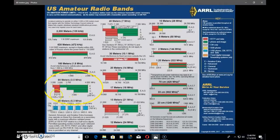Now, there's something you don't see on the chart that you may have heard people refer to, and that's 75 meters. People say, let's get on 75 meters, and you think — where is that on the chart? 75 meters is what some people refer to as the upper portion where the phone is, and they call 80 meters the lower portion where CW and data is. I'm not too solid on the history, but if I do anything on 80, it's PSK and digital modes in the lower portion. The antenna for 75 meters is roughly a little bit shorter than it would be on 80 meters.